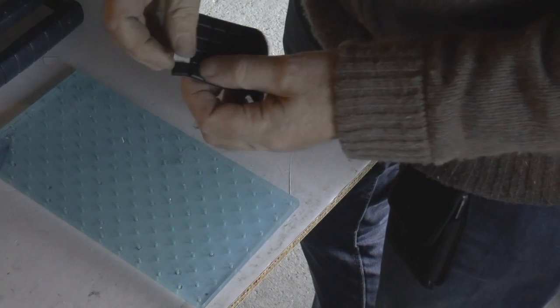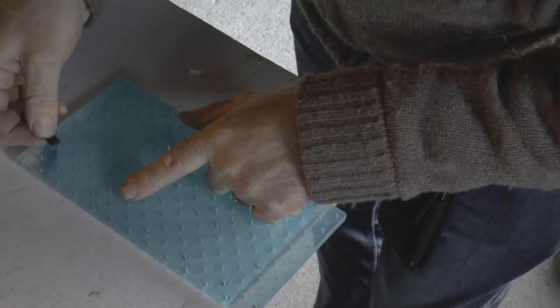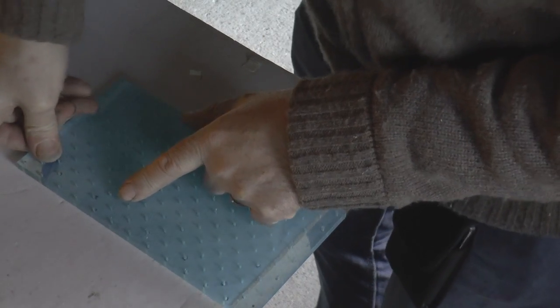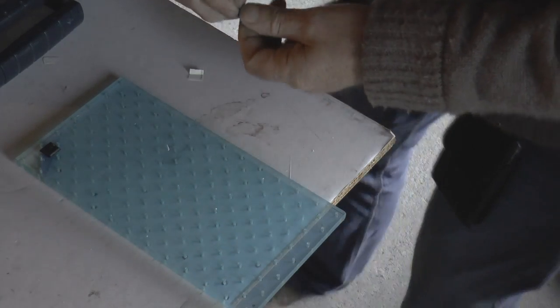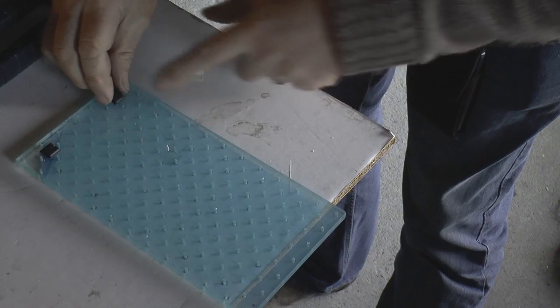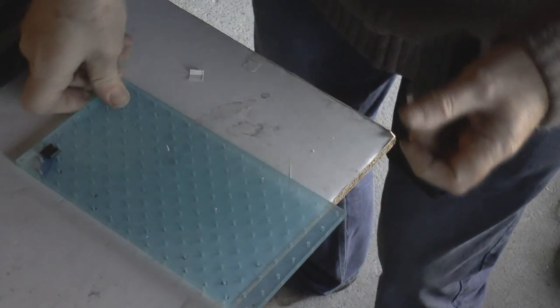What I'm planning to do this time is to put rubber feet on the corners, putting them in from the edge so that there's no chance that the laser beam can get anywhere near them. The laser is going to cut its way through eight millimeters of perspex and the residual power on the beam is unlikely to affect them.